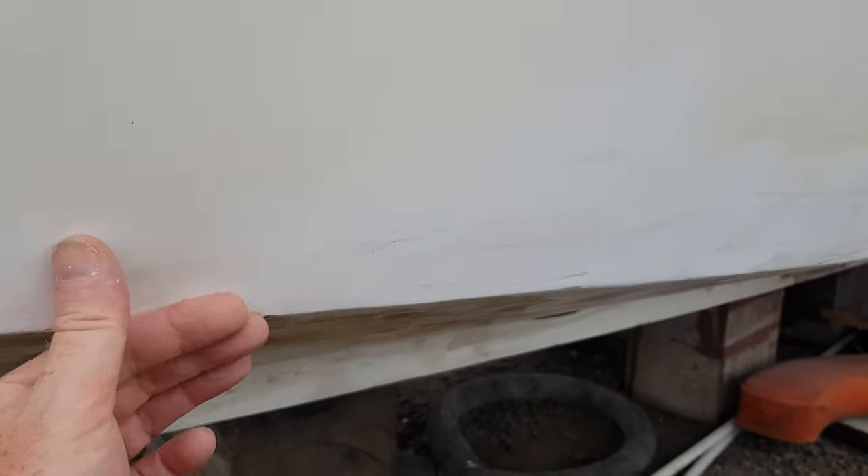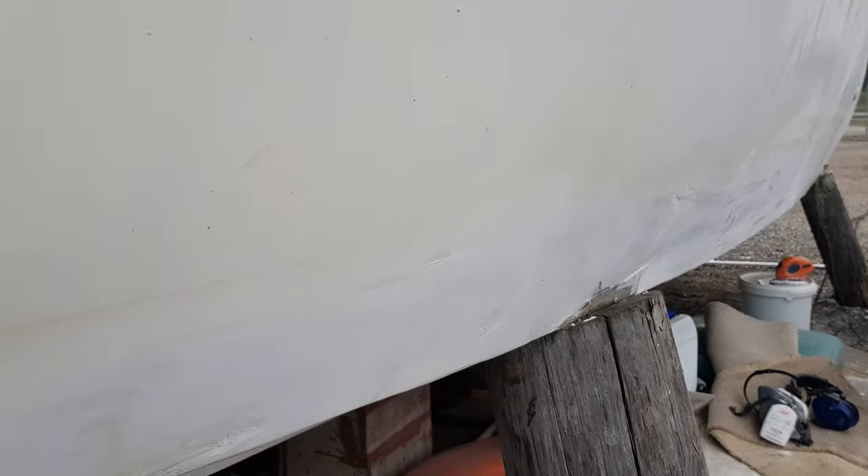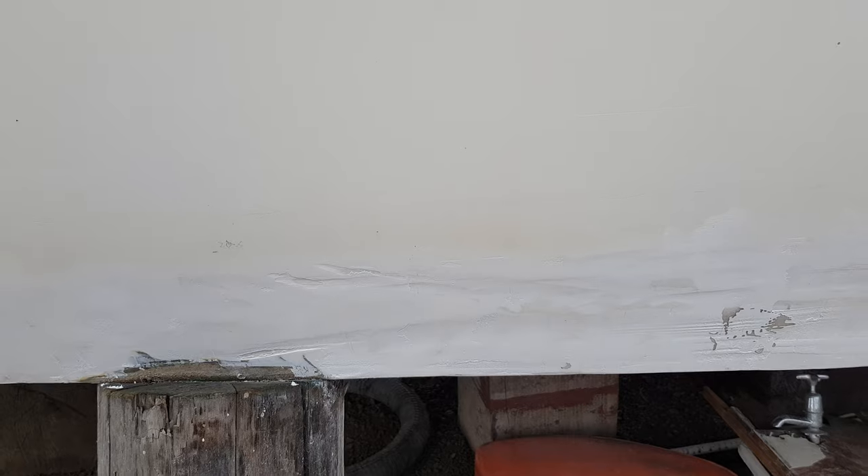This is one of the jobs in progress today. The filling we did with thickened gel coat we're just knocking back - it's still a bit rough over there. This is the first bit that I've done and it's looking pretty good. The only bad bits are low spots now so that's good. There's a lot of dips on this section so that's going to be refilled and fared. I made a bit of a hash of a bit there using a belt sander which is obviously far too aggressive.